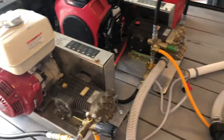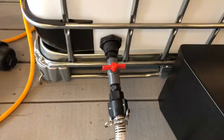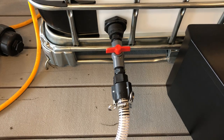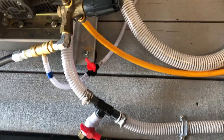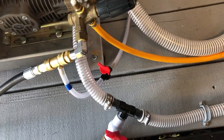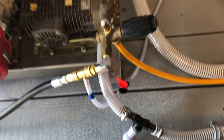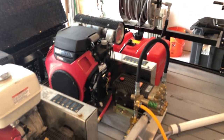We got the five-and-a-half gallon machine and the eight — both Bandit machines. The five-and-a-half is going to be fed by a one-inch line. It's got a one-inch bulkhead coming out with a three-quarter shutoff, goes into a one-inch Banjo cam lock, then through my Banjo filter straight into my pressurizing line — if I want to use it for a small job without bypassing the tank — and right into my machine.